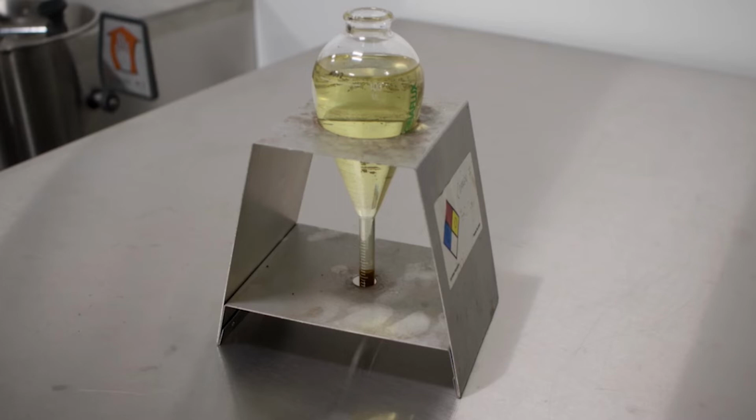So it is better to replace the entire bath and slowly add more particles until the correct concentration is met. This does take a little bit of time, but it saves so much more time in the long run and makes it so much easier on your operators to find any indications that there might be. So it is very crucial to get within the range of your concentration. So there are different ranges out there, but you want to stick within whatever your specification is.